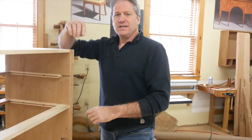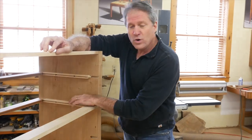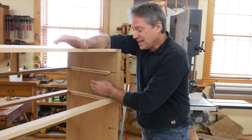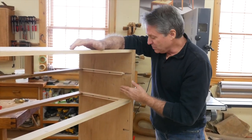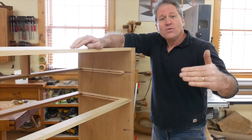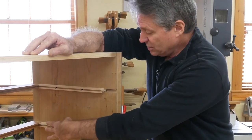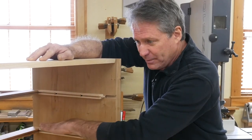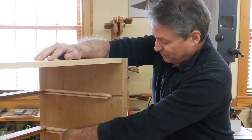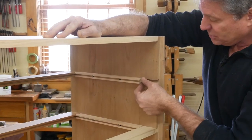All right, so we used to repair a lot of antique chests down in Pug Shop, and one of the common issues were, because it's a wood-on-wood runner to the drawer side, the runners would typically be dished out after years of use, and also the drawer sides would be also worn away. So rather than gluing these to the side or gluing them into a large frame, I'd prefer to have this floating runner here that attaches into the front and the back with just a tenon.